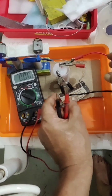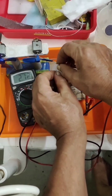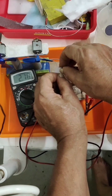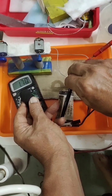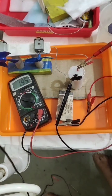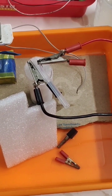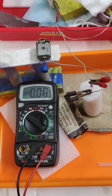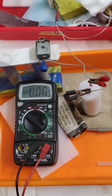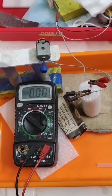I take out the external terminals and check the voltage — 2.12, 2.11, 2.11, 2.15 — it is charging. You can keep it for half an hour but I am going to keep it for just 15 to 20 minutes. This is a hollow cylindrical cathode electrode with a pillar-shaped positive electrode — a new design in lead acid battery.